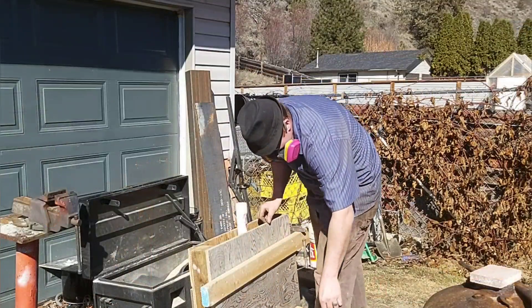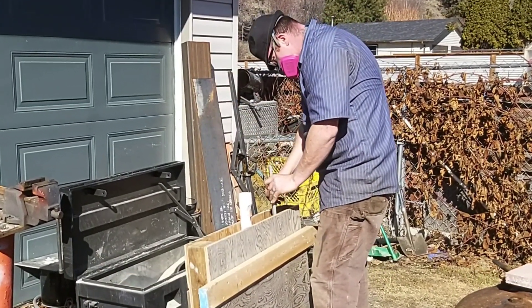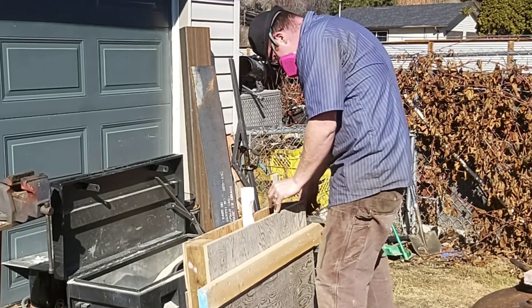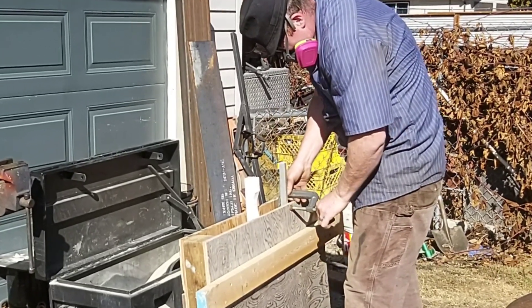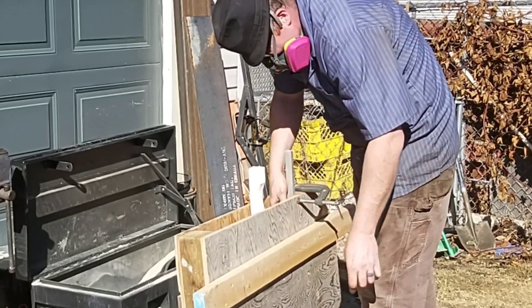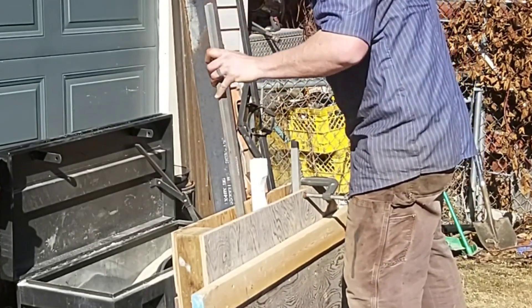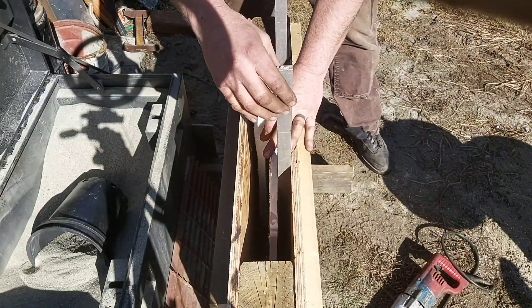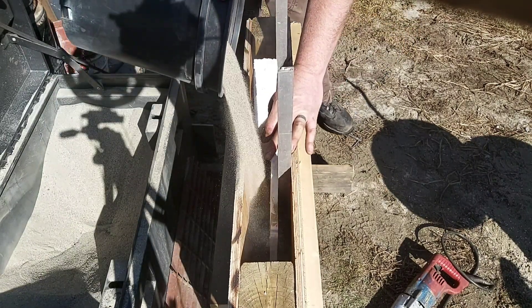I've created a bed underneath it and then I'm going to put these bars in here. The purpose of the bars is to stop the sand from bending the mold. This is a 24-inch round mold and there's a lot of flex that's going to happen, so I have to be very careful and take my time as I fill this up to make sure I don't bend that weak foam and distort it — because if I do, it's going to show in the end casting.